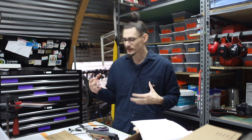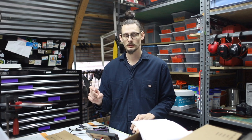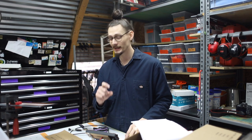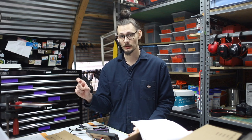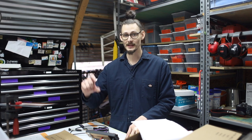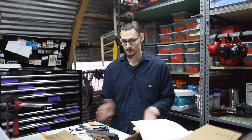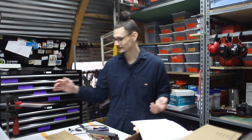So what we can do is determine the value of individual bytes, assemble the binary string, convert that to hexadecimal, and then pass it to the CAN bus, and the color changes. Simple, right?